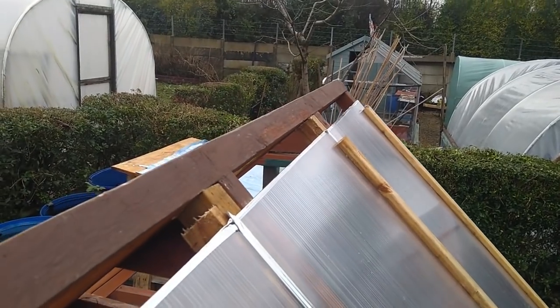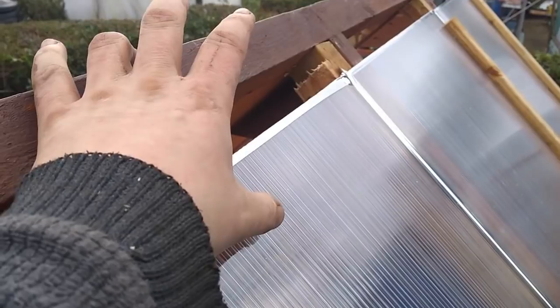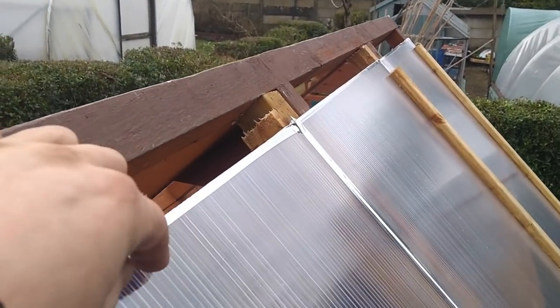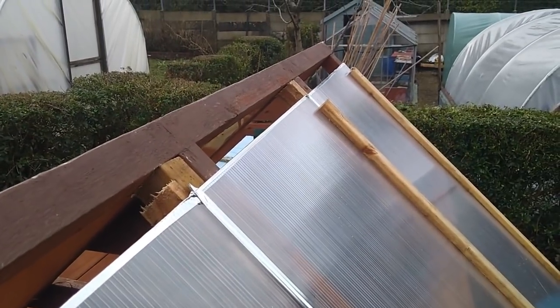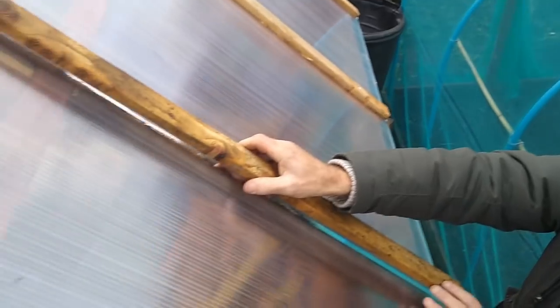Now I'm putting a 5-inch ridge beam, well, not a ridge tile, going across there. So that's going to overlap this, and it's going to be supported by timbers on the inside when it's finally done. But we're just getting the sheeting on now, making sure it's all level, which it is. It's level with this, and it's level with that base bit there. So we've got a bit of an overhang off the sheet into the gutter when the gutter goes on.